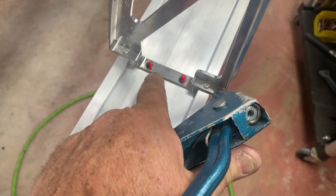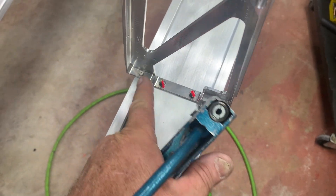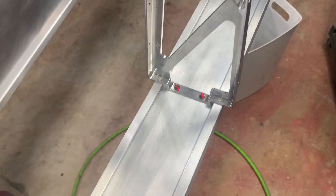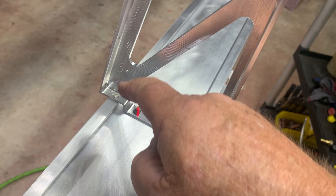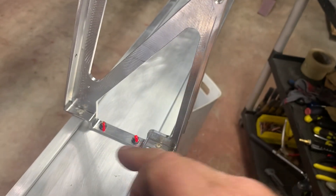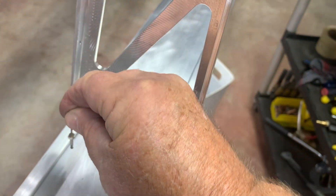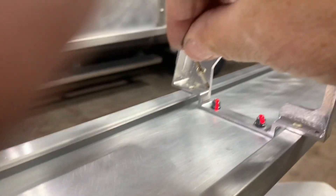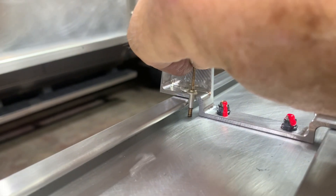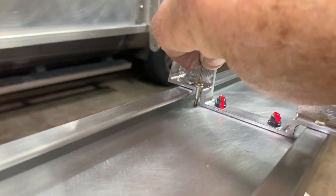What I've found is to take the screws here and just barely start the nuts on them — leave this loose. Put this one in first and you'll probably have to match drill to line these up since they're already pre-drilled on the spar. By leaving this loose with the bolts and nuts only lightly on, you've got a lot of room to move the part. Then go ahead and put your rivet down in here.